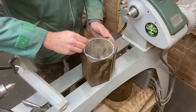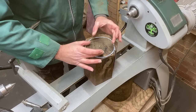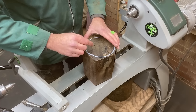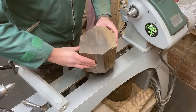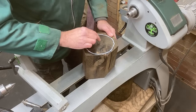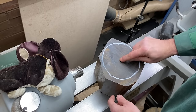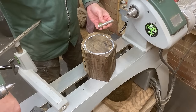The steps involved are: first, get it on the lathe between centres, then turn a tenon on one end so we can flip it round, hold it with the jaws of a chuck, and then start drilling and shaping. Now the first question is which end do we want to be the top? This end has a bit of a knot there so I think that's best being the bottom — in other words, that is going to be the top. It's the top we want to put the tenon on, so this side is going to have to have our drive spur in. We'll get it on the lathe, bring up the tail stock and start turning it round.